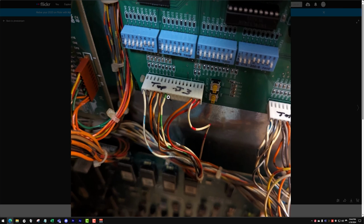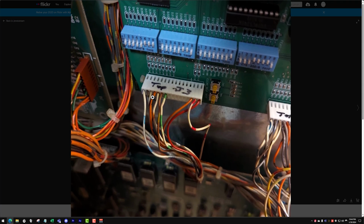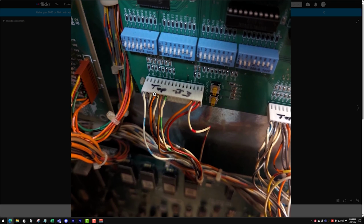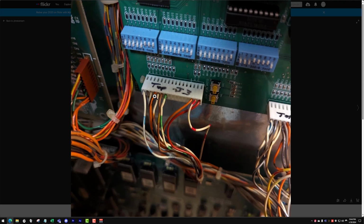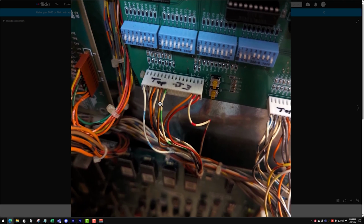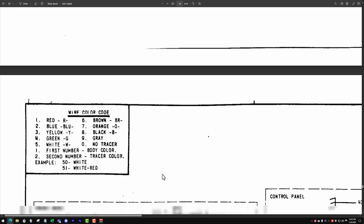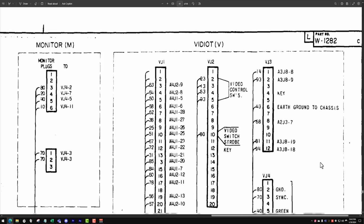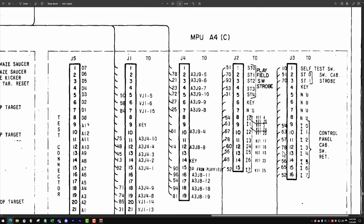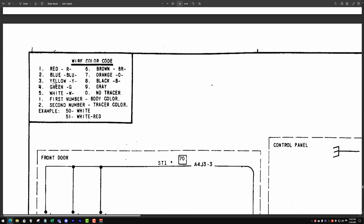So this wire, this white and green, should be over 1 to the right, which makes sense because there shouldn't be a wire where this orange one is. There should be an empty hole there. So I'm wondering if these 4 just need to be over 1. Let's double check. Let's see what this one is. This is a brown and yellow wire. So if this white and green should be over, and this is slot 9 and it's in 10, what should be in slot 10? Should be 63, whatever that color is. Should be a brown and a yellow.